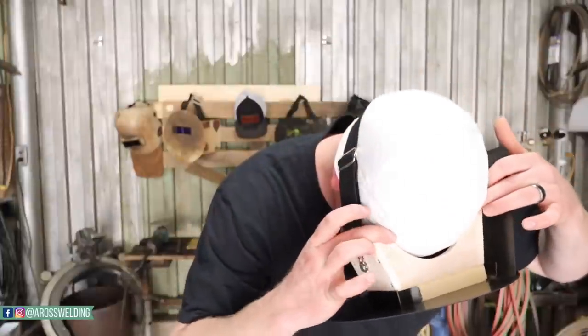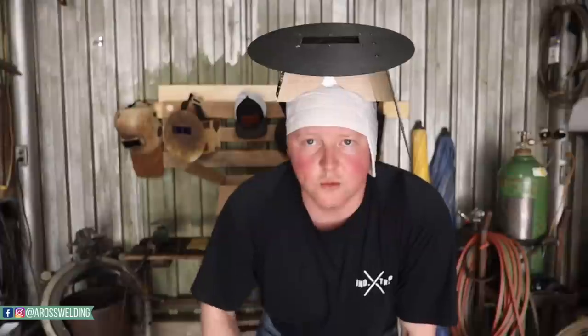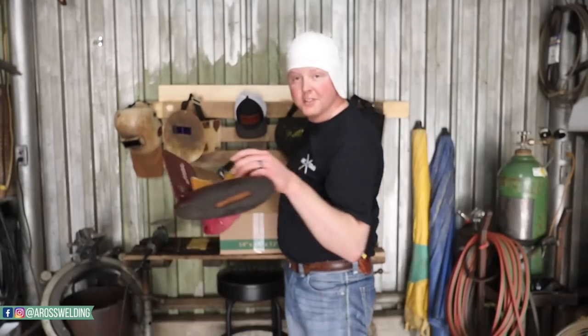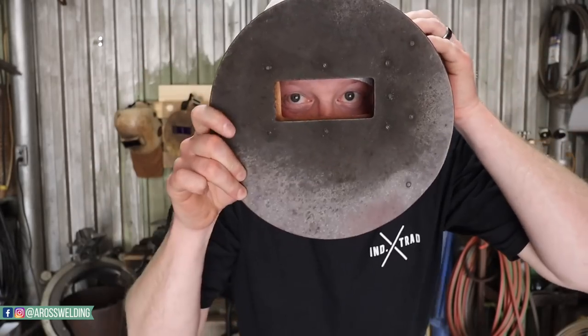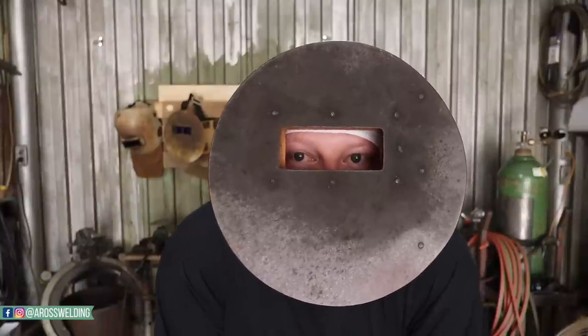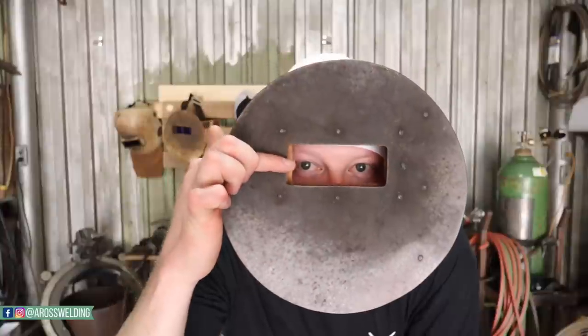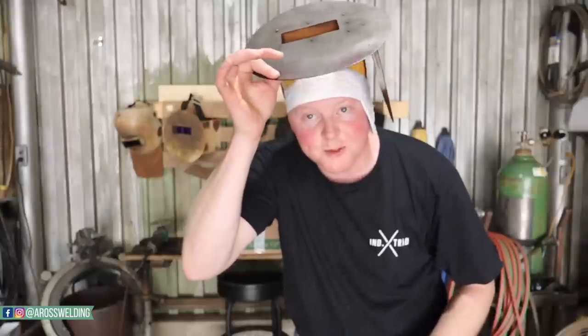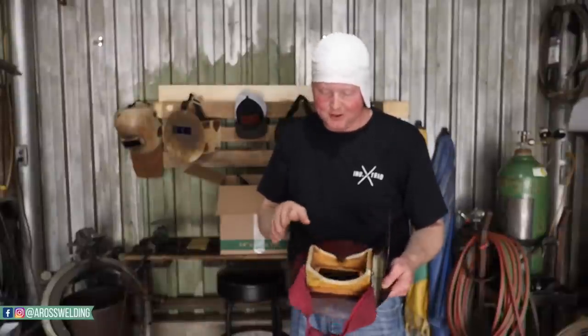I'm still getting a lot of pressure right here on my temple. Someone on Instagram asked where you want the pancake to sit on your face because they were having trouble fitting it. Fitting it without the lens lets you look in a mirror and check your eye position — my eyes aren't directly centered unless I angle down a bit. The main deal about fitting a pancake is sanding down all the high spots, anywhere there's a pressure point. It's actually just like the branch fitting test: anywhere it's touching, sand it down — same concept.